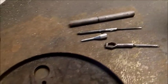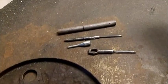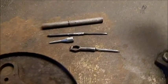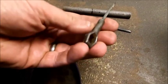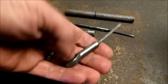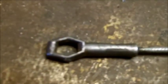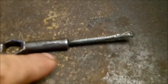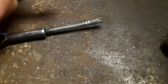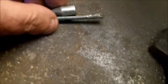My cable kit is on order via AutoZone — three or four days ago. I called them today and it's supposed to be in, but they said the vendor canceled the order. So this is going to be my shortening kit. I'm going to cut this thing open — the factory hook eye for the front where the pedals are — cut it open and get the cable out of it, and weld this set screw piece inside of it.